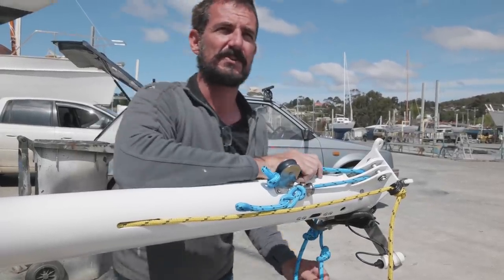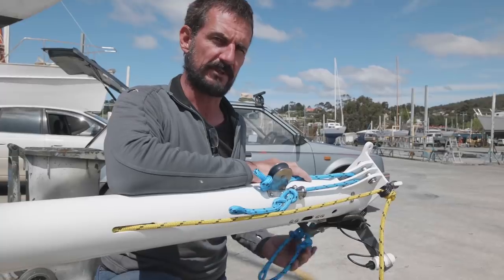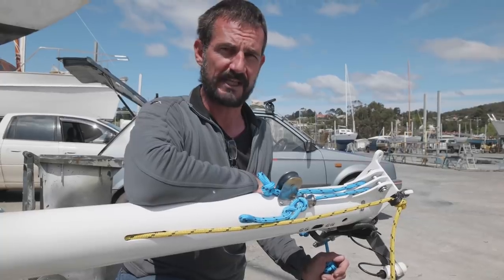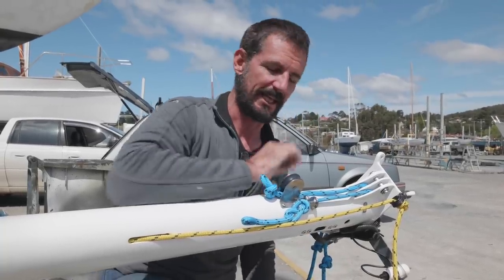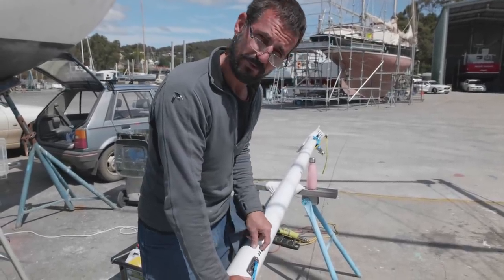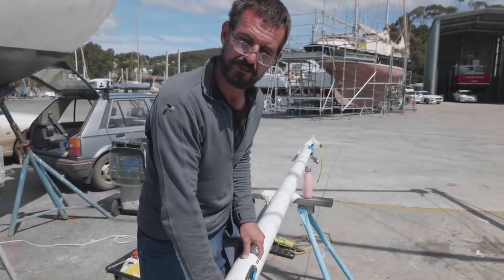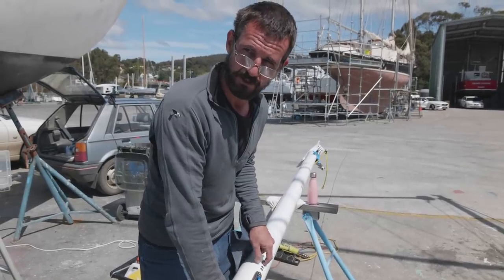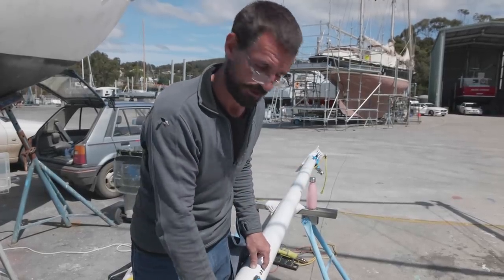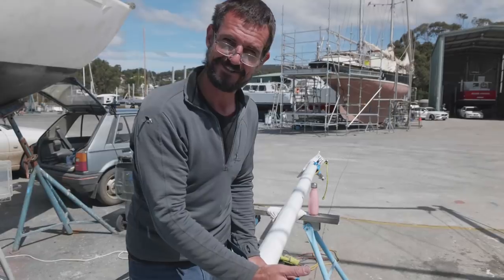That's all right. In boats with a high turnover of crew, it's a pretty good idea to have things colour coordinated and different, but we can get away with it because it's just us. What that meant is that we could buy all of this rope in a 100 metre roll and save a few shekels. That's why they're all the same colour, except for our cruising spinnaker. Moving down the mast, this is the next thing. We put in provision for an inner stay, so that should make things safer in heavier weather. We'll be able to remove this if we want, down the bottom, and have it close to the mast if we want better tacking with our Genoa. But we can have this stay, and now we've got a halyard, so we're going to have two headsails, which I'm really excited about.